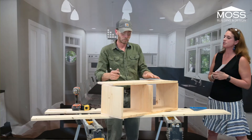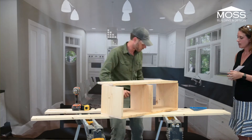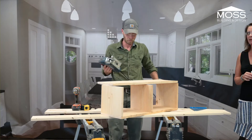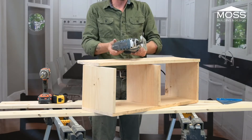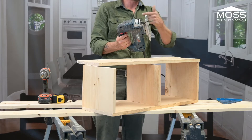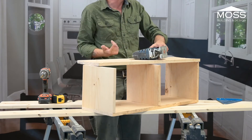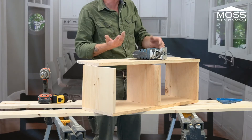The circles have been drawn. Since I'm using the jigsaw tool — please put on your safety goggles — the jigsaw is a reciprocating tool. There are multiple types; the Sawzall is another reciprocating tool. What that means is the blade goes back and forth inside the chamber of the tool, versus a circular saw where the blade is spinning. The mechanics of the tool dictate the safety methodology when you use it.